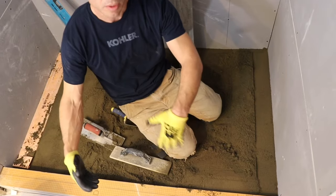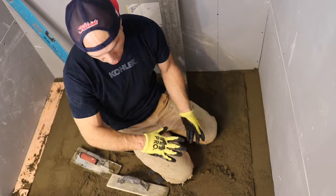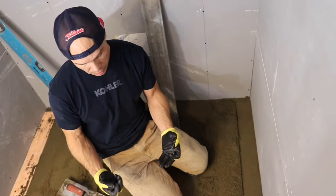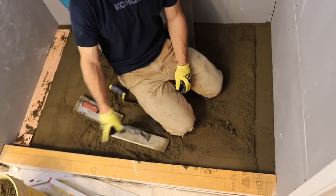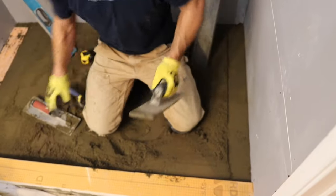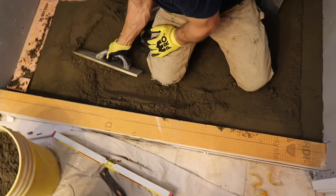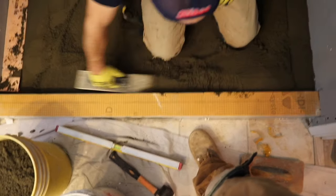And then we float over that, or we put board over that and then waterproof it. Usually it's just hot mopped right over it and then we float it. But what happens, if there's moisture in that slab, it makes the wood swell and then it contracts as the humidity goes down. So around here, we end up with a lot of cracked curbs. And so we've gone to the Kerdi-Board, which has been pretty awesome. I'm really happy with it. I buy the full sheets of 2-inch Kerdi-Board, and then I just cut them in my shop, 4 inches wide or whatever you want them. And you can pre-make a bunch of them. That's pretty slick.